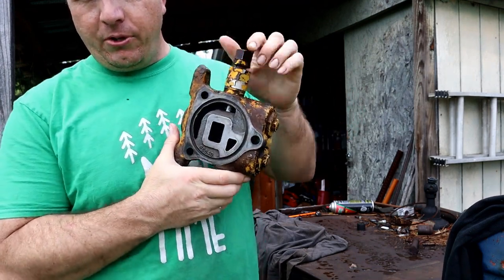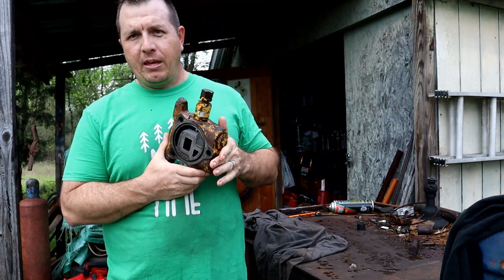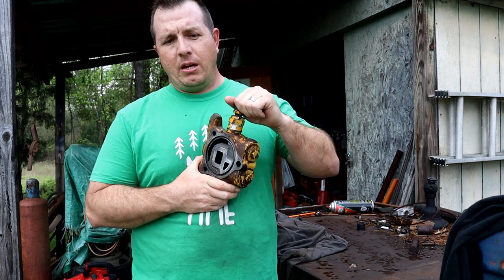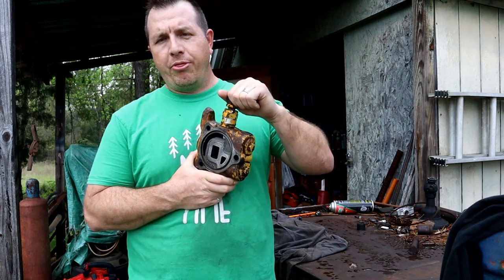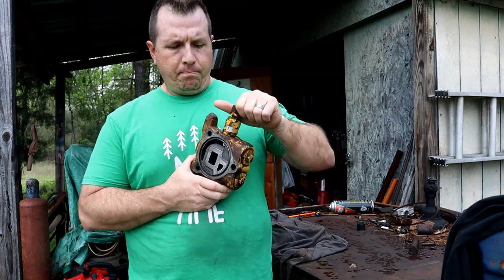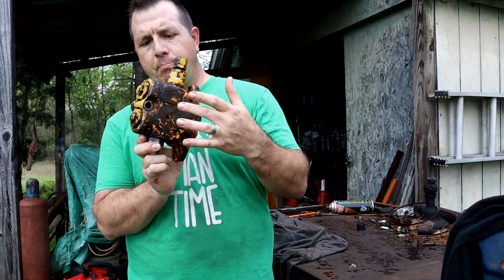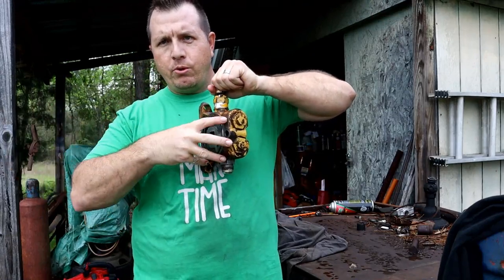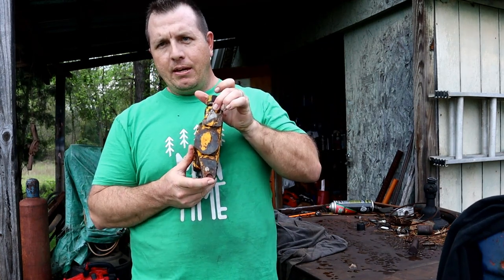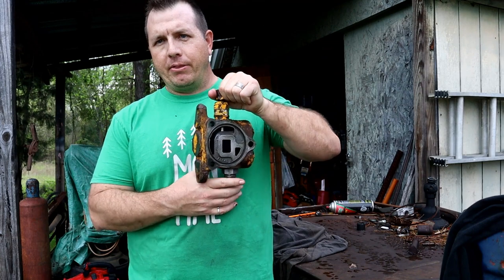And if you're wondering how to get this off of your tractor, well, it's the most difficult thing I have ever done on a big diesel industrial piece of equipment. It was about 50% easier than just taking the whole thing off of there. Two things I didn't have to do was remove all of the hoses, labeling them as I took them off, and then remove all of the levers from the top of the spools. But I mean, these three bolts, there's three through bolts through the whole system into here. And then there's two bolts on here and one on the other side that holds the entire spool to a mounting plate on the backhoe.